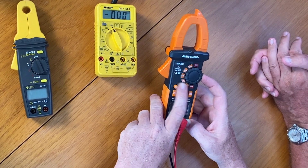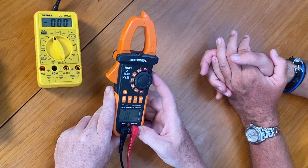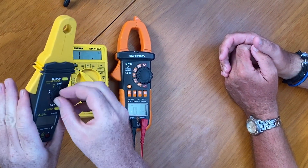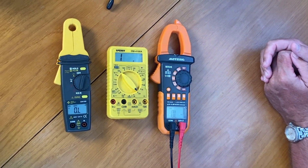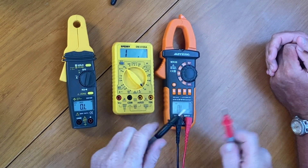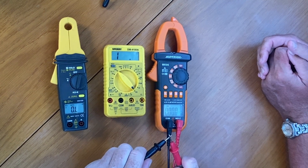So there's that funny impedance symbol. If we put it on that setting, let's demonstrate first. Right now it says OL, or overload — sometimes it'll just show dashes. So the first thing to do is make sure your meter is working. If I connect these probes together, this should go to zero, showing that there's good continuity. Then you would take this and connect it to one end of a wire and the other end of the wire. Or if you're testing a fuse — a glass fuse or any type of fuse — you can put it on either side of the fuse to make sure it's good. You can do it on a light bulb as well, anything to make sure there's continuity through it.